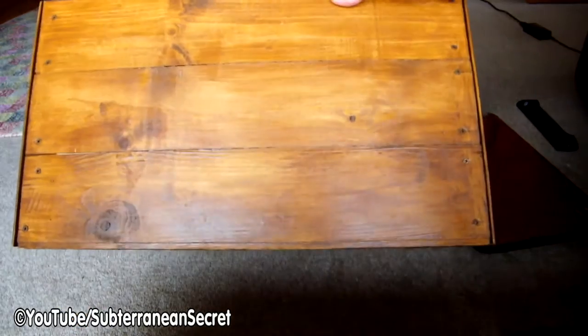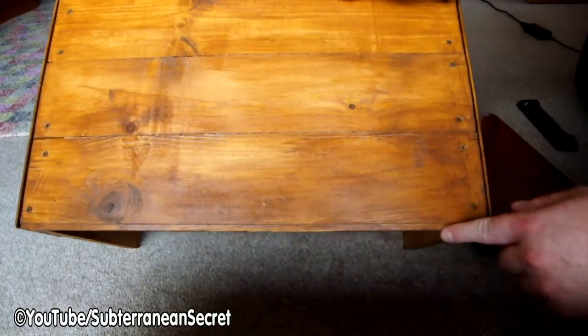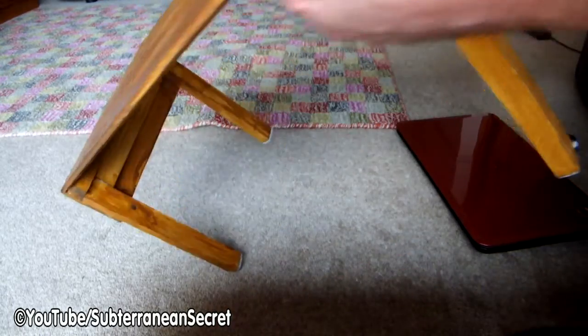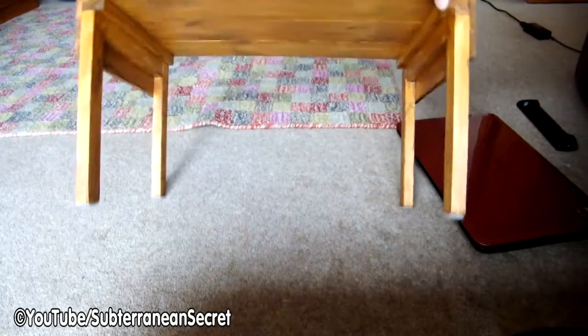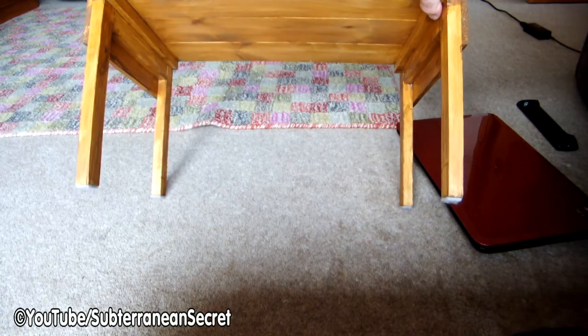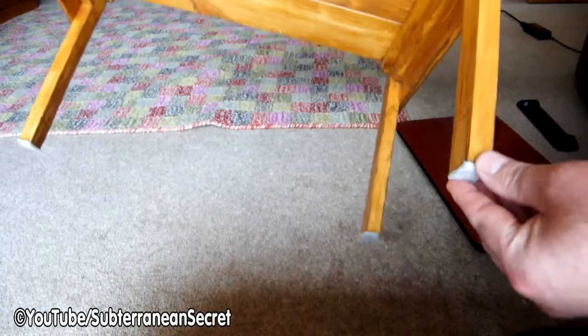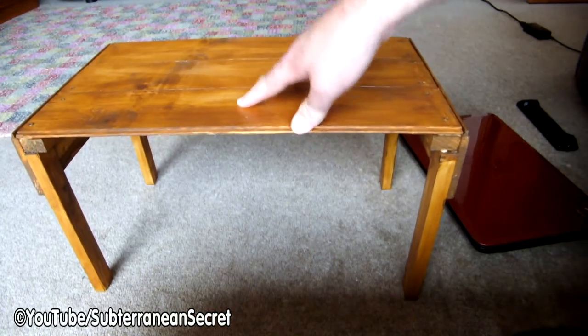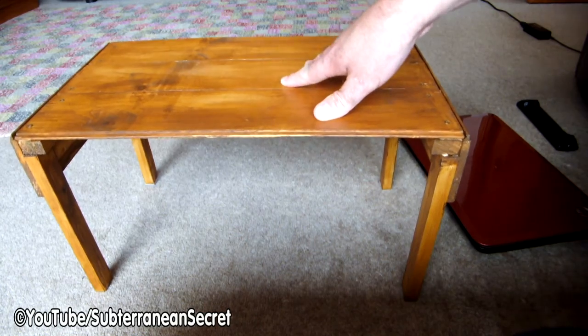Screws will probably cost you around two to three pounds — get a pack of a hundred for around that. You don't need any specialist tools, you don't even need a drill as long as the screws are nice and small — they should go in with just a crack in the wood. All you need is a saw and a screwdriver. In terms of skill level, anybody with average DIY skills can do this quite easily. The legs don't have to be completely straight since you'll be using this on an uneven surface like a bed or settee.